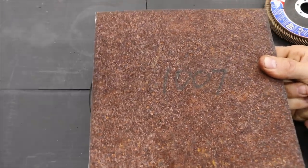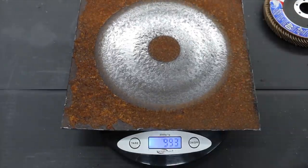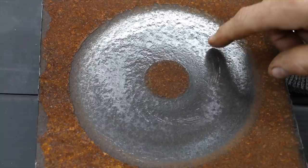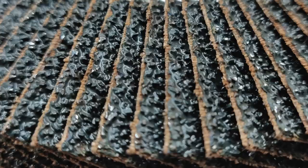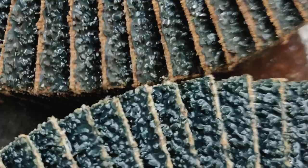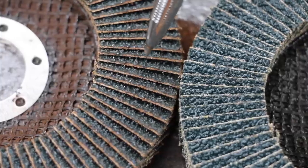The piece of steel used in the Diablo test started off at 1007 grams and now weighs 993 grams, a loss of 14 grams. The Diablo did a pretty decent job of removing the rust scale and did pretty well as far as wear and tear. There is a little bit of grit loss along the leading edge just like with all the other brands. Comparing the new to the used, you can see that this Diablo wheel has a lot of life left in it.